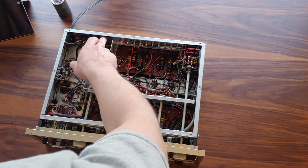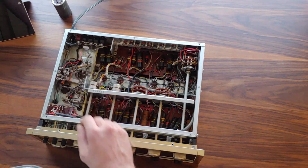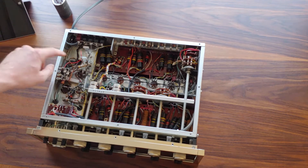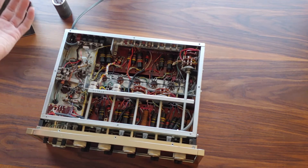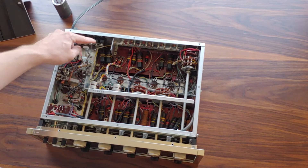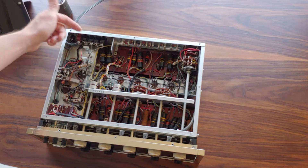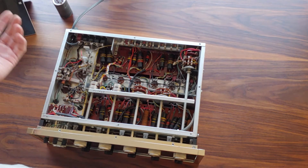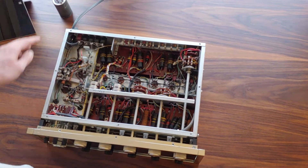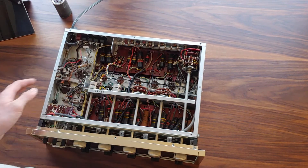All of these outlets are fused. I'm never going to put anything on it — maybe a turntable — but there's no need for these to each be able to carry more than an amp besides the size wire they used on the inside. That being so small, you don't want too much current going through these, and I don't want too much heat on any of these wires. So the one amp fuse will protect all of these, protect the switch, and protect the preamp itself.